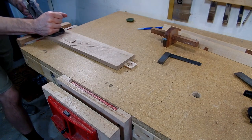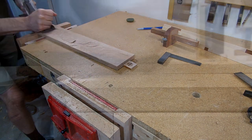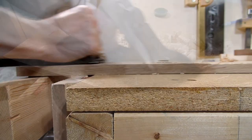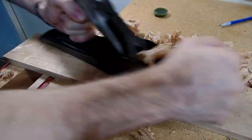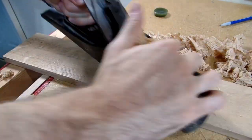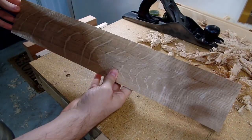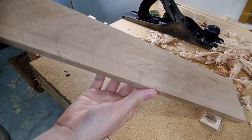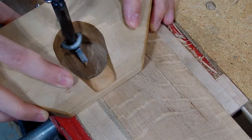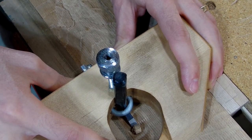With the second edge square and my piece now at its correct width, I could move on to planing the remaining face to its correct depth, and here you can see one of the first of many mistakes I had while building this project. When I was resawing this long board, I experienced a lot of internal tension in the board and struggled to saw a straight line. I ended up cutting a pretty big gouge into the face of this board, which was pretty frustrating as quarter-sawn white oak is not cheap. Since the wood isn't cheap and this is a project for myself, I had the idea to cut out the hole and fill it with basically one big inlay.